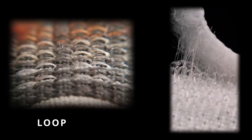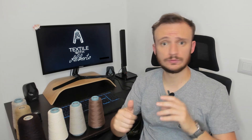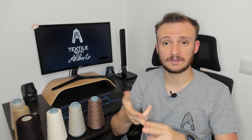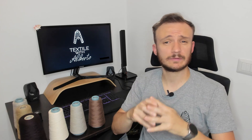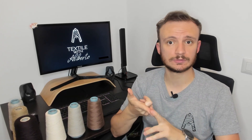The first side is the tougher side and is created by weaving small loops. These loops are then cut and heated in order to become small hooks. The other side is created with softer yarns that remain open with flexible loops. The two sides are then glued, sewn, or thermo-welded onto surfaces or onto the garment. The strength of the hook generally depends on the number and quality of the hooks.